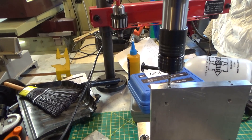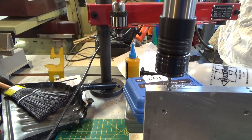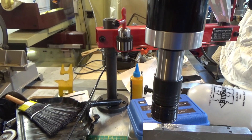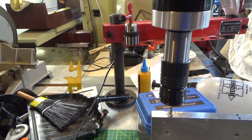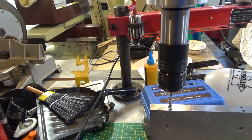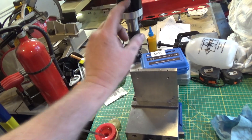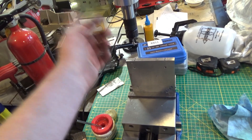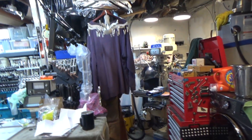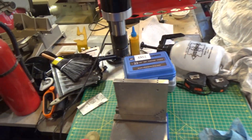So we're looking at the depth - I'm six millimeters in. I'm shooting for 20 and paying careful attention to the tap. There's 20, that's three quarters of an inch roughly. One thing I found is you really have to clean the flutes well - you cannot risk having any crud in the flutes. Power tapping is better than by hand because my mill doesn't have enough overhead with a chuck, tap handle, center, and the part sticking vertically. I think I'm going to stick with power tapping and see if I can dial this in. So far, so good.